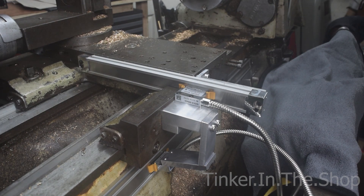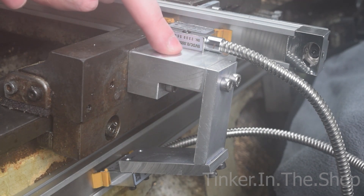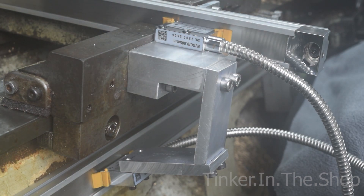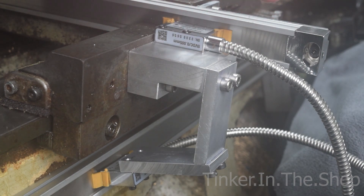I'll bring you down into the Z axis. This is just a bit closer view of the brackets I arranged. Basically there's one main bracket with two Allen bolts underneath going into the saddle. From there we have the X sensor, which is just bolted down — that's adjustable, two bolts — and then the brackets for the Z.